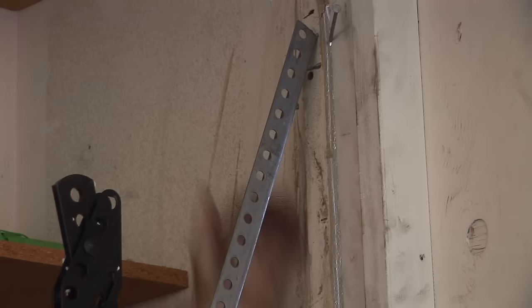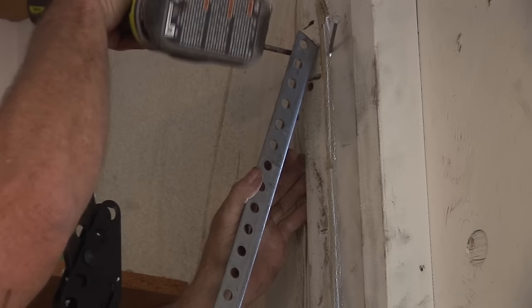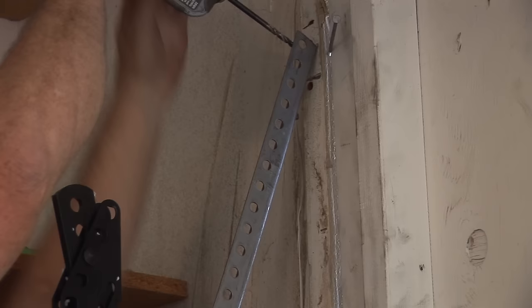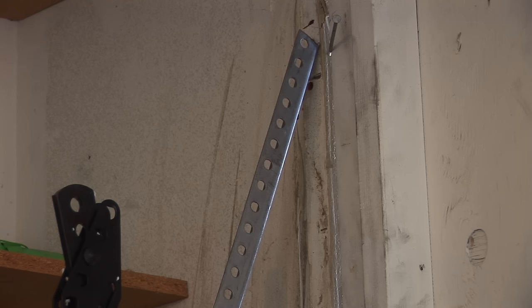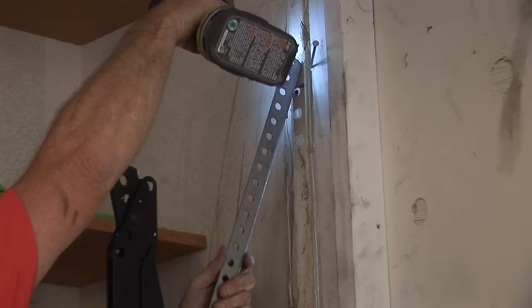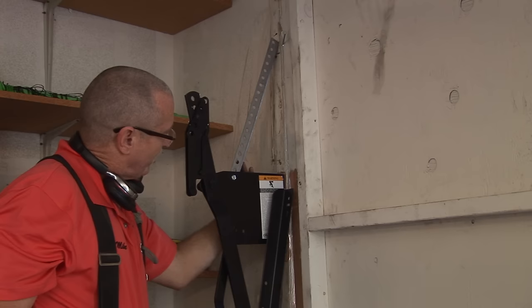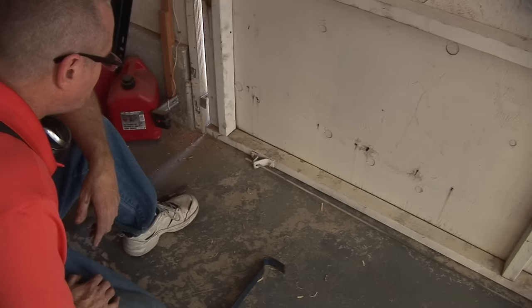Usually go up around 20 inches or so for the brace — I could go higher or lower, but the higher you go the more strength you'll get out of it. I'm going to go to the very top, start a pilot hole in there, then angle the lag slightly down to make it harder to pull itself out. Running a pretty long lag. Typically what happens when the jamb wood gets weak is the top lag will pull out when the door is raising, and the bottom lags can hold but they'll bend the plate. This brace is going to prevent that.